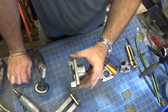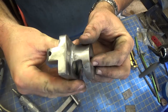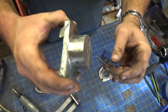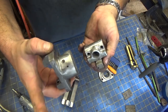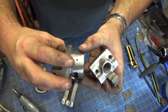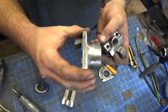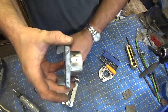So anyway, I have this roughed out. You can see that the flappy paddle does a good job of getting past the thick stuff, but it leaves some unevenness, and I'd like to take that out of there. So what I'm going to do now is move the camera around and bring out the 1x42-inch belt sander, and use the elasticity in that belt to try to smooth out any problems that I've created here with this flappy paddle.